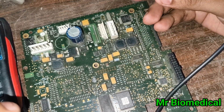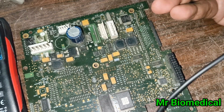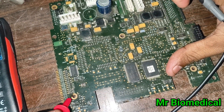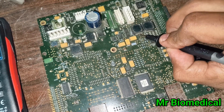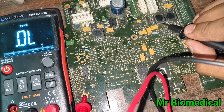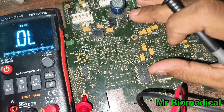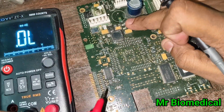The inductor gives a buzzer sound but it is not working like a fuse. It boosts the current flow of the circuit. You can see the short sound here and here, but if you touch the ground pin and then touch the inductor it won't give you the buzzer sound. Sometimes if it does make a sound, you can assume there's a short circuit issue inside the board.